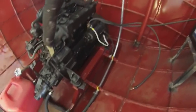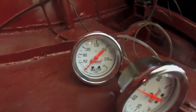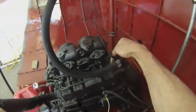Here's the setup. It's been running for half an hour — no leaks down here, no leaks here either. I ran it for half an hour; it's about sixty degrees outside. Still didn't get any registration on the water temperature gauge. Maybe the gauge is faulty, but I don't think so — because here's where it comes out and I can touch that. So it's probably like ninety degrees just based on how it feels.